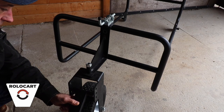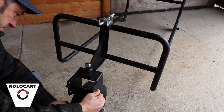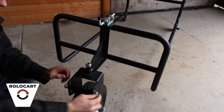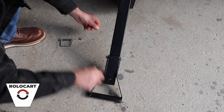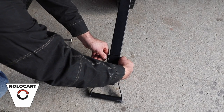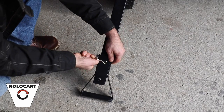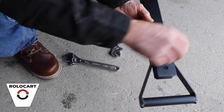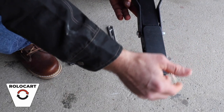You can take the tongue yoke or the trailer hitch — there are three sets of holes, so go ahead and put that in whatever height you need depending on how high your quad or lawn mower sits off the ground. Install that and tighten the bolt down with the locking nut. Now let's grab our handle — there's about a three inch long bolt you're going to slip right in the hitch at the back of the handle, and then a little more forward there'll be a removable pin. When you're going to tow with your lawn mower, just pull that pin out, fold the handle out of the way, and use that same pin as your hitch pin.